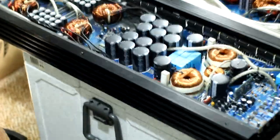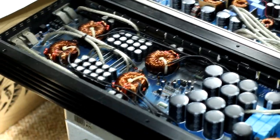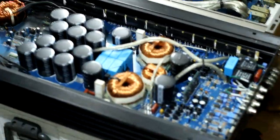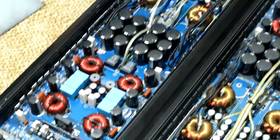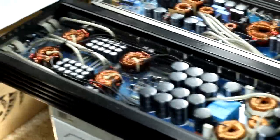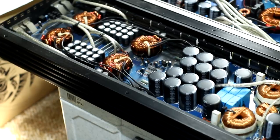The final one is a slightly smaller version. I think it's still rated the same 8.5K, but as you can see, we only have 4 push-pull transformer sets, and we have 2 half-bridge amplifiers that then parallel after the inductors on the outputs here. So the bigger ones will be higher current, just generally more badass shit going on. For those of you that want to do the 0.5, 0.25 burps, etc., these are going to be the ones that do that. This would be fine for a daily 8.5 system wired to 1 ohm, or if you're running very efficient subwoofers like the DDZ4s or Z3s or 9.5s or pretty much any DD woofer, this will also be fine